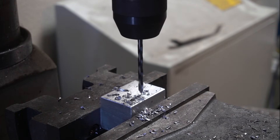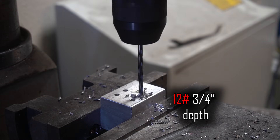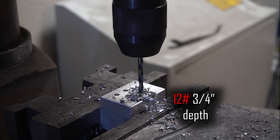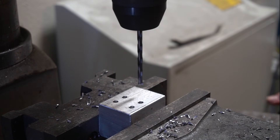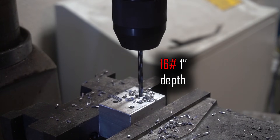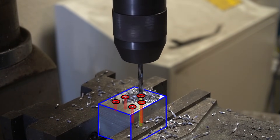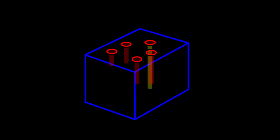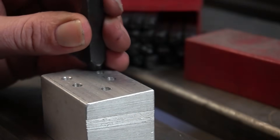As far as the holes and depth are concerned, I'm only drilling to the standard sizes that I use — in this case, it's going to be 4, 6, 8, 12, and 16. If you want to drill one for every size, have at it. Once all of your holes are drilled, you should have something that looks kind of like this. Here's the wireframe geometry — you can see the different depths on each one of the holes to signify the different amount of stick-out.